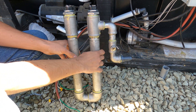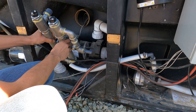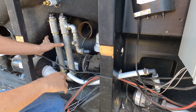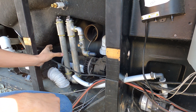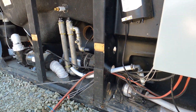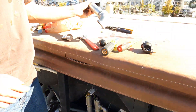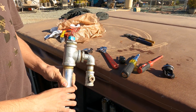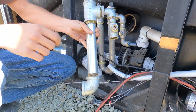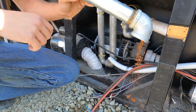We can turn these on in stages. I have a solid state relay that fires one of them and the other one has just a regular contactor. This is all out and loose because the first time I built this I used galvanized pipe. Check it out up here - this is the other half of what this used to be. You can kind of see the resemblance and the problem we had is this galvanized pipe rusted out.